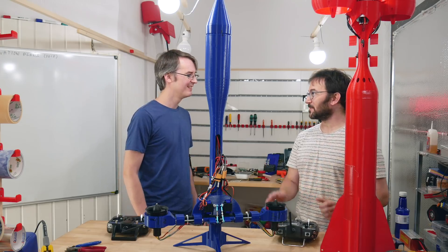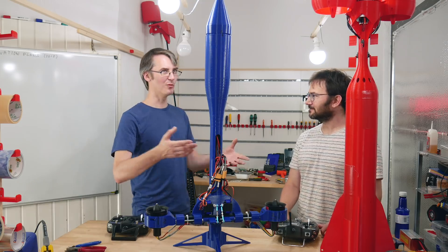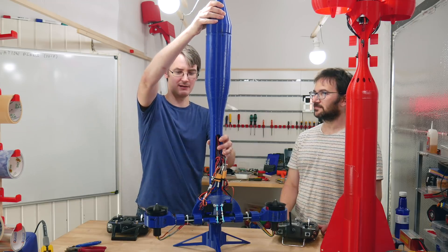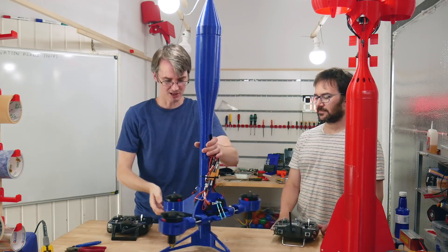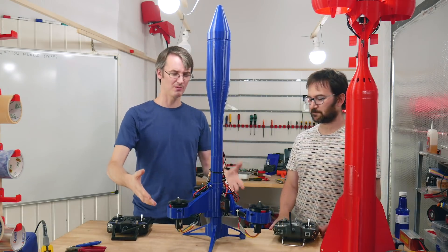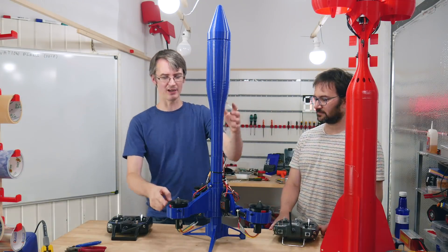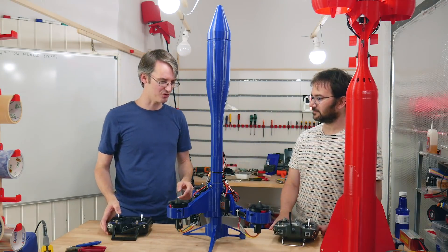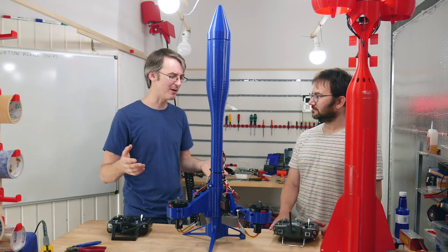So James, I did put the engines on top of my rocket — why did you put yours on the bottom? Mostly because I thought that's what rockets should look like. Mine's a little different where I've actually got an inertial measurement unit in my nose cone, which means as I tilt it, I should try and balance all of these EDFs, of which there are three — a bit of a weird configuration. It's a bit like a drone but with three, and hopefully these two overwhelm this one, and that one helps stabilise it that way, and these help balance it this way. I've also got the ability to counteract the spin because they all spin in the same direction, but I might have to tune it in software depending on how it goes.